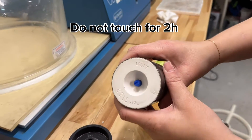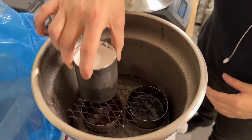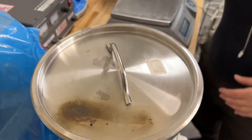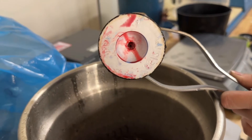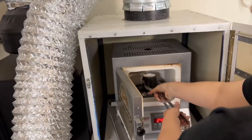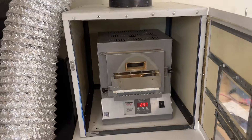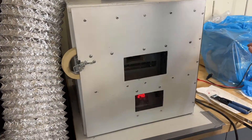What I like to do next is to steam most of my wax off for 45 minutes. I then prepare my kiln to the proper setting I have programmed for a burnout. Don't forget to ventilate — I have a homemade particle and charcoal filtering system. When the kiln is near 300 degrees I put the flask in. There is a ramp up from 300 to 1350 degrees and it takes about 6 or 7 hours.